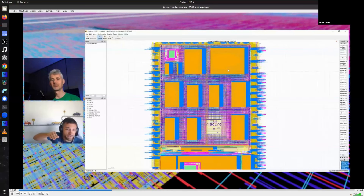We took the list of sensitive registers and applied Triple Modular Redundancy (TMR): for each sensitive register we make three copies with majority voting logic. If one bit is flipped, the other two override it. This makes the design super-targeted protection for this specific program against single-bit fault injection. We then tested in reality whether that actually works.